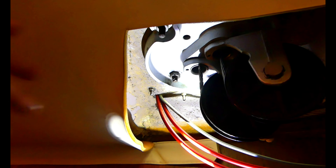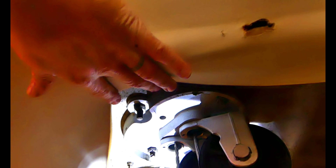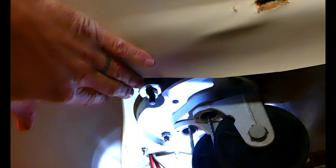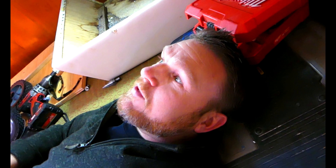Down in the rear quarter berth — Will's abode — this is the base of the binnacle with the cable steering. There's what looks to be a 3/8 hole there. I'm going to enlarge it big enough to fish through the cables for the chart plotter. It's some pretty thick metal but looks to be aluminum, so with some step-up bits I'm hoping to make quick work of it. With eye protection on, we blasted a hole through. Got through — now we can fish the cables from the top side.